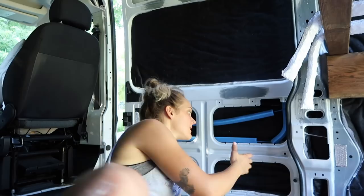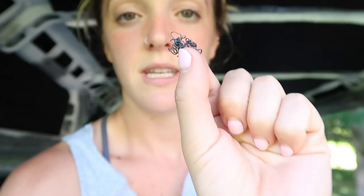Something I want to talk about is the fact that the edges of the van are very sharp. I'm going to throw a clip in here from my insulation video. It's a pretty good gash that I sliced from pulling some insulation through. That can happen to your wires, which would be very, very, very bad. Even just from running the wire for my front fan, I wanted to show you what accumulated — it's the outer coating peeling from me pulling it through that hole in the van. One of the best things is to make sure wires are really protected so that down the road, that outer coating doesn't get worn away and expose your wires to your metal van. I did pick up some conduit that's already split, and then I picked up some rubber grommets to use in areas that are a little bit tighter.